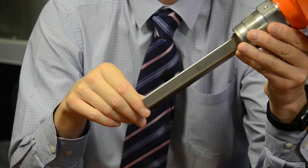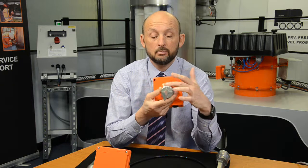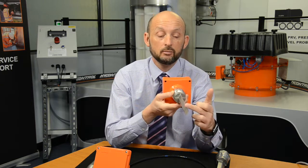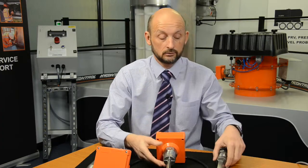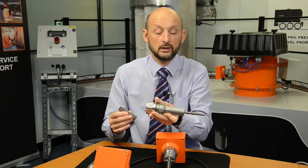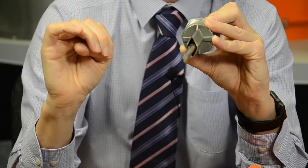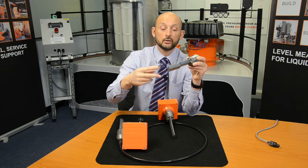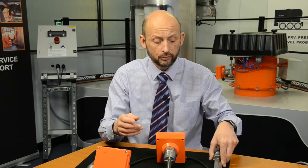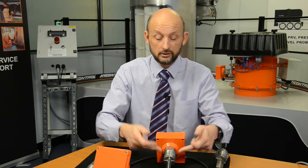Here we have a classic side-mounted vibrating level probe. We have a crystal in the back of the level probe which vibrates this sensor — you can see it's a diamond shape. Inside this probe is another probe. Here's one which I've cut away so you can see there is a rod inside the diamond, and this gives a big advantage because it prevents the tuning fork from getting blocked up between the two forks. The whole principle is vibration — like a tuning fork at school where two forks resonate.